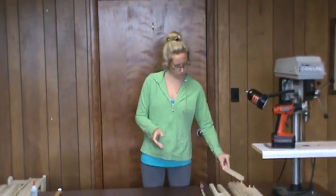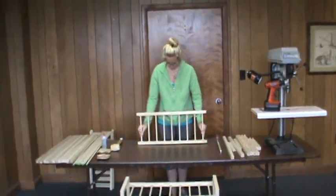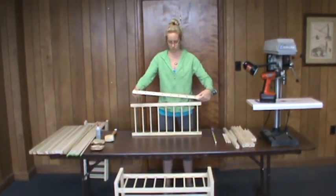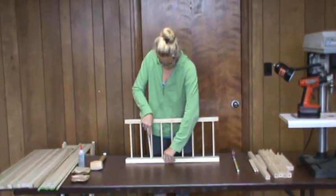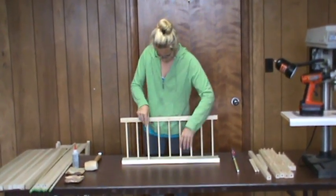We have pre-assembled the 4 shelves. To assemble the shelf, place 1 frame piece on a hard surface with the holes facing up. Insert a dowel into each hole. Sand a slight taper on both ends of the dowel to make an easier fit.